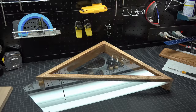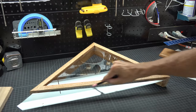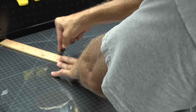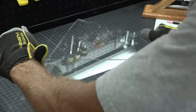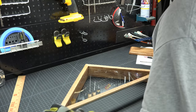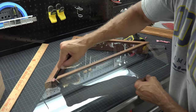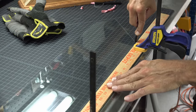I'm a bit nervous about cutting the glass for these display cases. Laying the triangles on their sides, I slide a corner of the glass pane into each frame and with a grease pencil make my mark. On my first cut my yardstick slid a little, but I got lucky and the break was clean — it fit very well. Always handle glass with gloves, especially after cutting, as the edges are extremely sharp. For the mahogany display I clamped down the yardstick so it would not move, and that cut came out perfect.